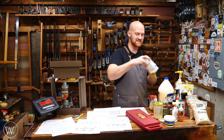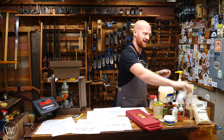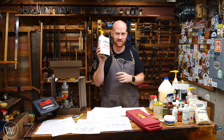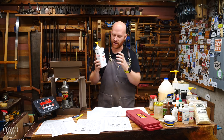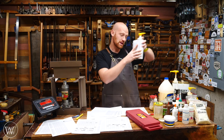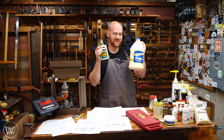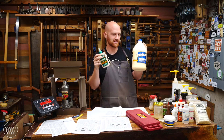Number one of the epoxies, slightly higher, was the East Coast resin. Right behind that, just by a couple pounds, was the West System epoxy — and in particular, it was the West System fast epoxy that did better than the slow epoxy. I kind of thought the slow epoxy would do better, but in all cases except end grain, the fast epoxy did better. Close behind the epoxies, you have Titebond 3 and Titebond 2 — about 10 PSI between them, with Titebond 3 doing ever so slightly better.